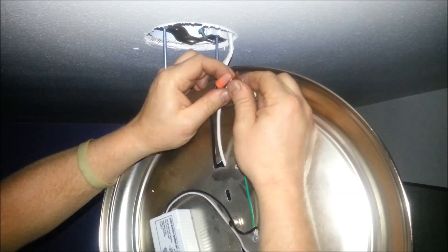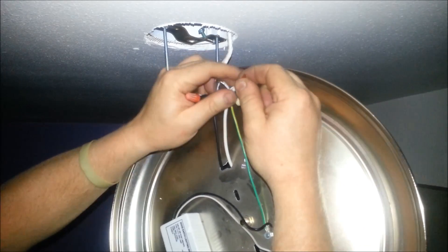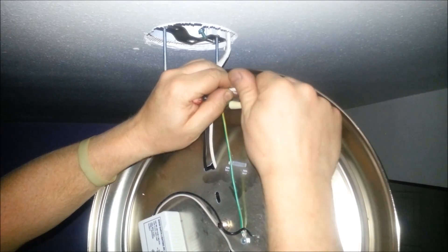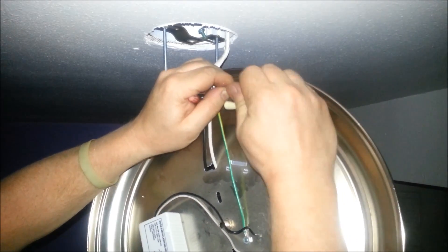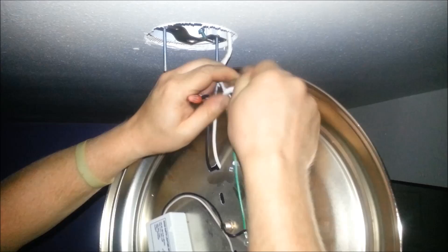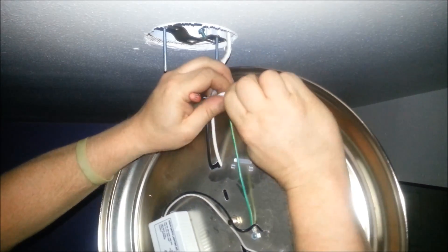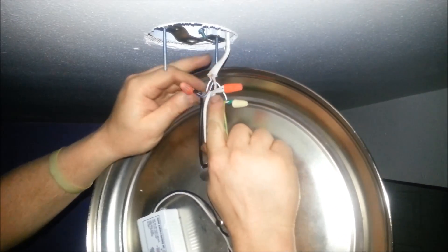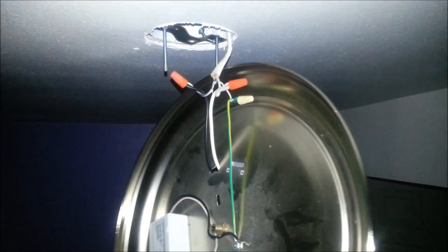Keep going until it actually grabs the wire and the wire actually wants to twist around each other, down and towards the base. I'll take this white one and stick it up just a little bit higher. Crank it in and just keep tightening it until it grabs — see it grabbed? Now twisting the wire nut actually wants to twist the entire assembly, and that's not going anywhere.